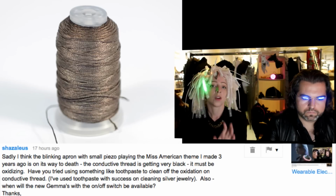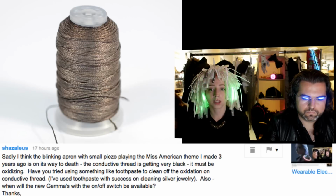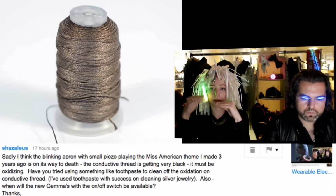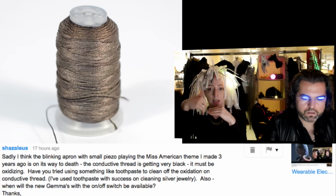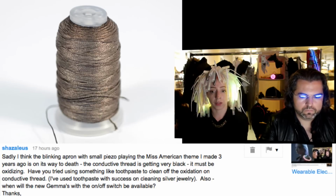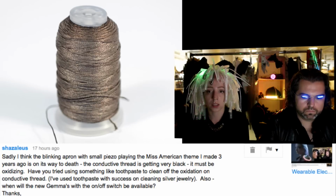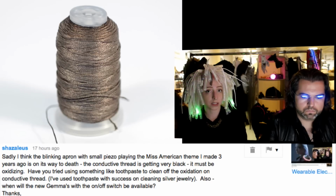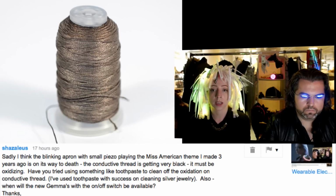Great guy. The thread was really fun to work with, actually, but then, yes, it oxidizes because it's silver-plated nylon, so there's little bits of silver all over the nylon, and as they oxidize, the oxidation gets between each of the little bits and prevents the flow of electrons. So I feel your pain, Susan. This happened to me with lots of stuff. That's why Adafruit carries stainless steel conductive thread, so that this won't happen to your projects.